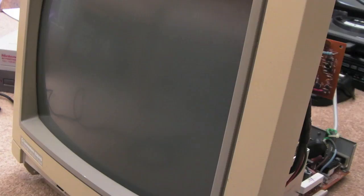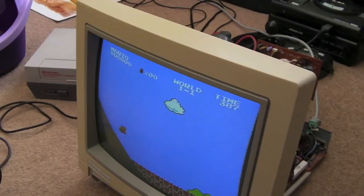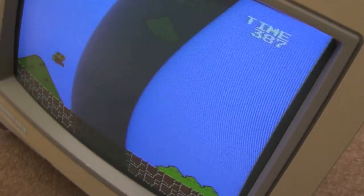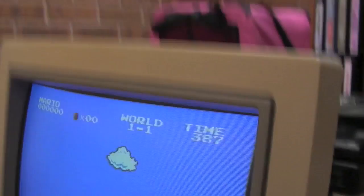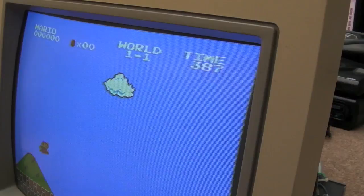And as you can see, straight on, perfect. Sorry about that band - it's an artefact of the way it captures on the camcorder here. But yeah, perfect stable picture now, colours are fine from the tantalums I swapped out earlier. I think we'll call that a success - it's the end of another journey really. I just need to swap out that 27k resistor when it arrives. Overall I'm very pleased with the way this has turned out - it's had numerous issues from caps, we had a dry joint, we had that resistor that you've just seen, we had the tantalums.